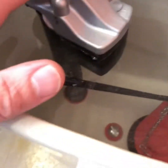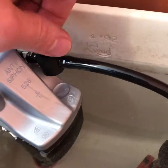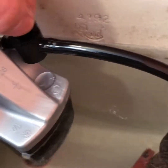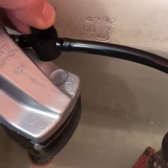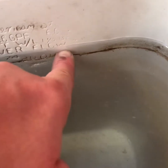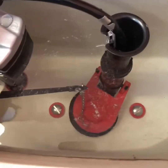I wanted to talk briefly about this: all the way open versus all the way closed — this depends upon how much water returns into here and fills up your bowl. I typically will have it halfway. The more open it is, the more water your bowl fills up; the more closed, the less water you use because this reservoir fills up sooner and there's less in the bowl. We are higher than we used to be here — I can always lower this so the water shuts off sooner. But I'm going to flush it one more time and see how we do.